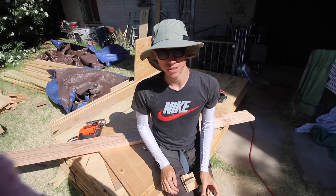I've got the joist in place, so I'm just going to take some of these two-inch nails and drive them in. That one's done — now I have sixteen more to go. By the way, I'm not blindly putting these up. I actually went along and measured sixteen inches on center all the way down before I started putting them up.